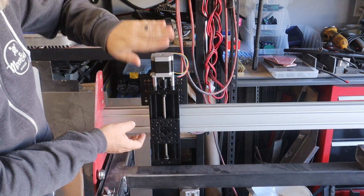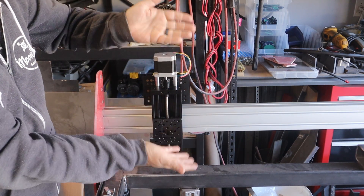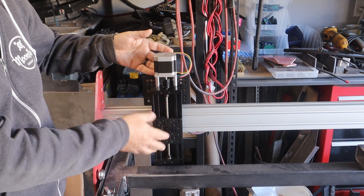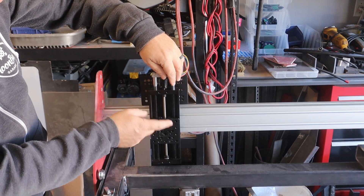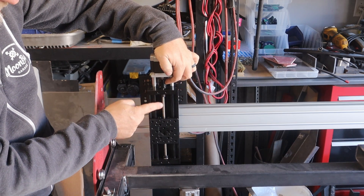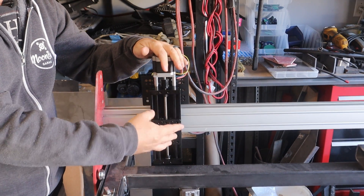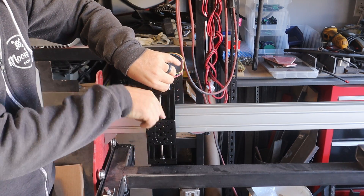Let's start with the Z axis. Forget the motor for right now — I bought this entire assembly as an assembly. You can get them with or without the motors, all different brands out there. Since I bought my motors as a four-pack, I bought the unit without the motor. What this does is the motor connects to the assembly via this coupler right here, and that coupler is attached to the end of this screw shaft. As the motor turns, it raises and lowers this plate, and your plasma cutter torch will mount to this plate — that is what controls your Z axis, or the height of your torch.